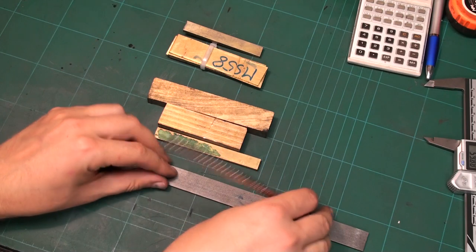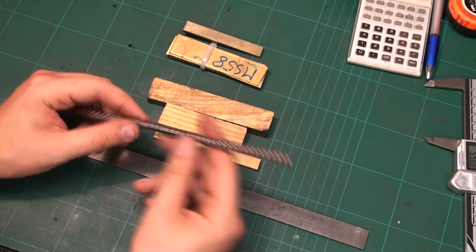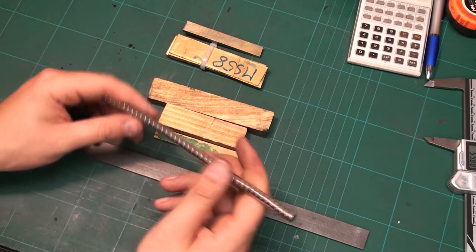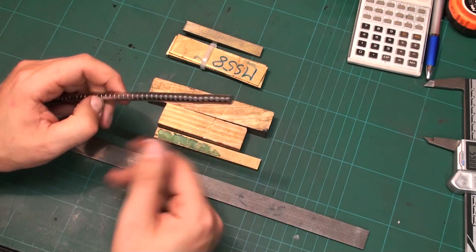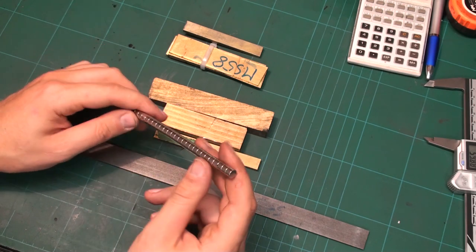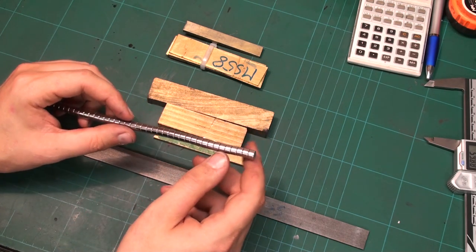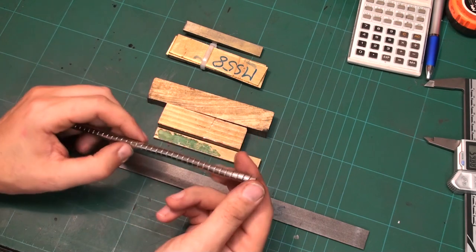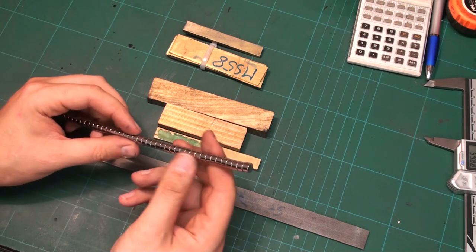You can get a handful of these rather strong neodymium magnets for a few bucks on eBay. The problem with these is they are quite brittle. It's almost impossible to machine them with an end mill or on a lathe. And when you surface grind them, you get a pretty impressive spark shower because the material tends to be quite flammable in dust form, or grinding dust form. Also, when you run an end mill into them, you're in for a surprise.